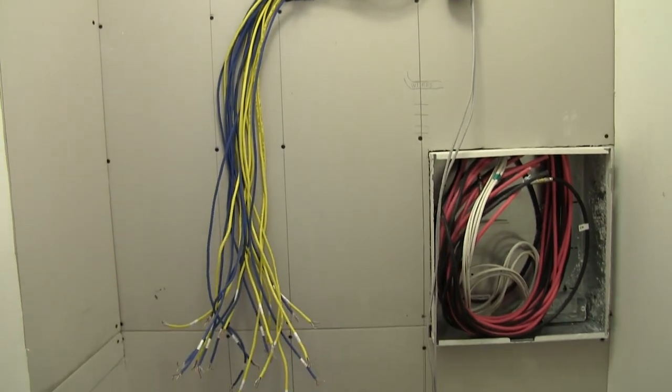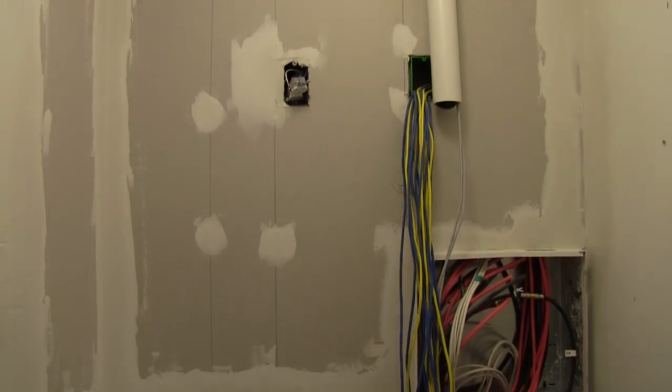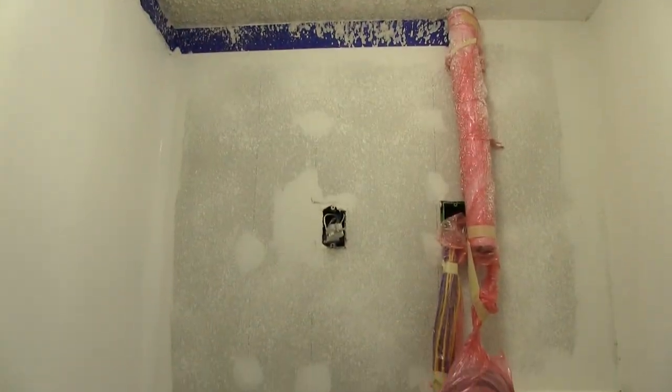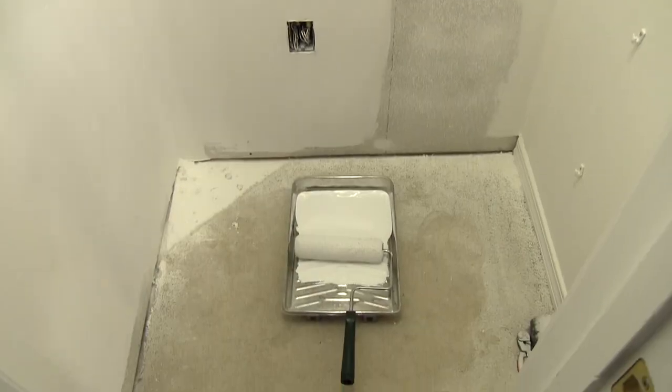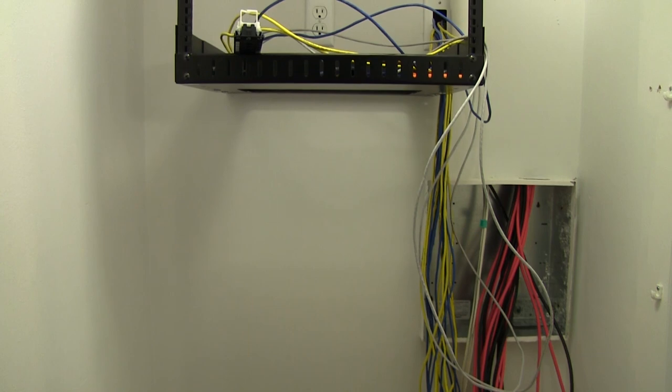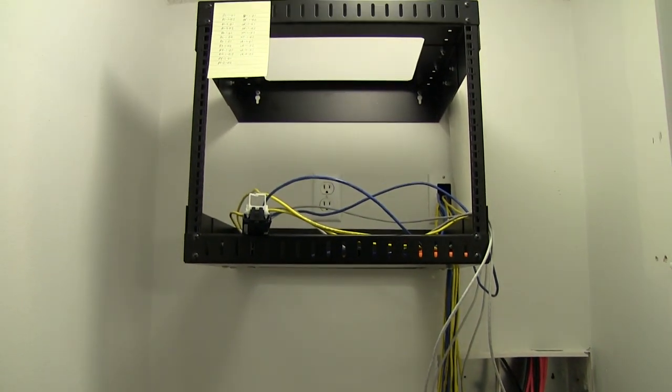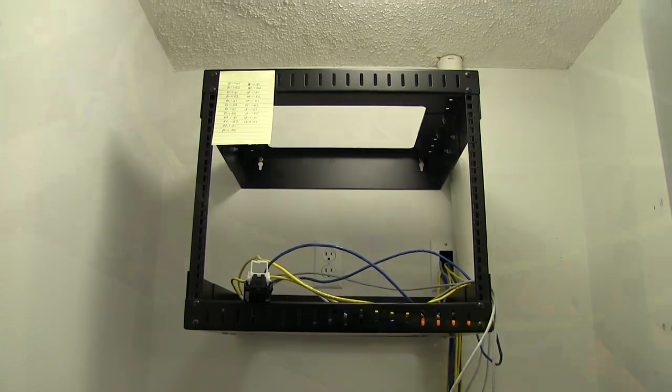I break out the joint compound and drywall tape. Yes, those terms are very misleading. After that, orange peel texture in a can and popcorn in a can for the ceiling. It helps to cover up the items you don't want to splatter texture all over, and splatter's the name of the game with this stuff. When your texture is dry, it's time for a fresh coat of paint on the wall. I went with white. Wow, it feels so spacious in here.